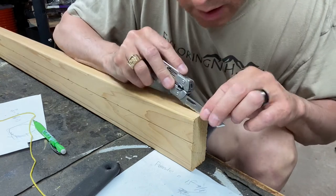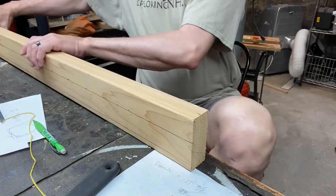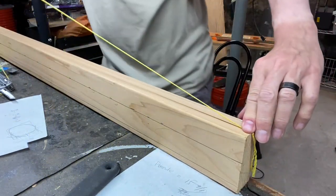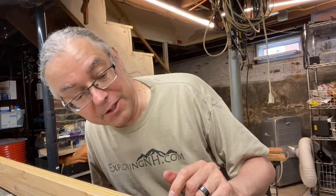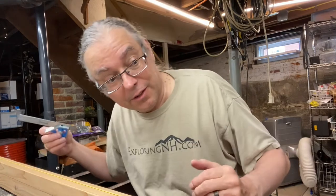Seam down here. Put the knot in there. Now that's the center line, a straight center line of this piece of wood. You know, if the piece of wood was curved one way or the other, and if you had just measured, marking every foot down like that, you would get a curved line. I got a nice straight line here. That's all, I'll mark it up now.